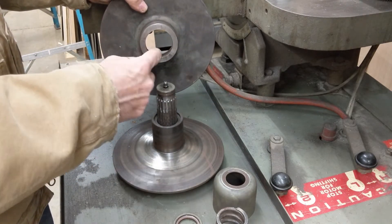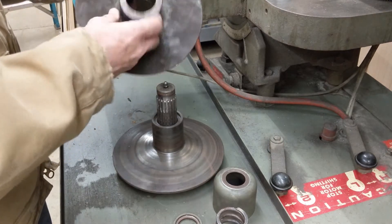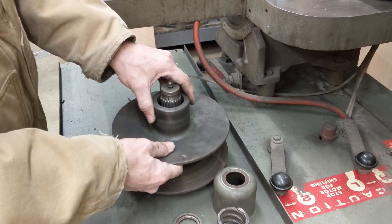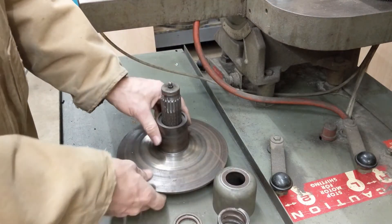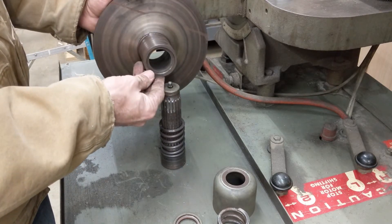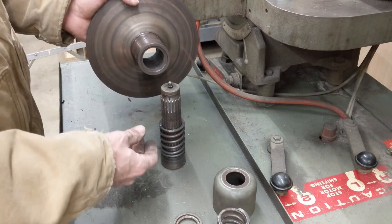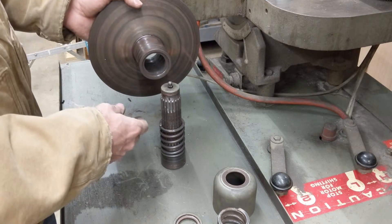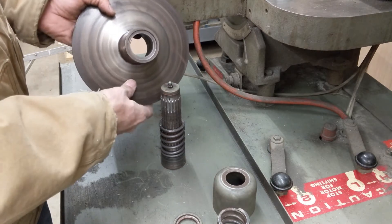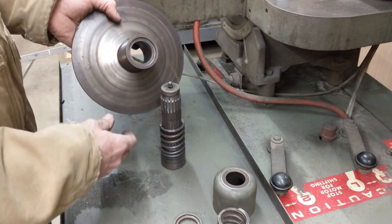The original intention was to get a piece of spline coupling and braze it in here so it could slide on some spline shafting, but there's not a whole lot of material to work with. This is also supposed to slide on this shaft and from spinning around it's probably okay, but it's not a real tight fit either. The spline area is only about three-eighths of an inch wide, so there's not a lot of area to work against the spline when this thing starts up against the inertia of the pulley assembly and the large pulley on the transmission input shaft. If this thing dries out and runs out of grease, it's just going to keep working back and forth — cast iron is brittle, it'll just pound and pound until it falls apart like this one did.